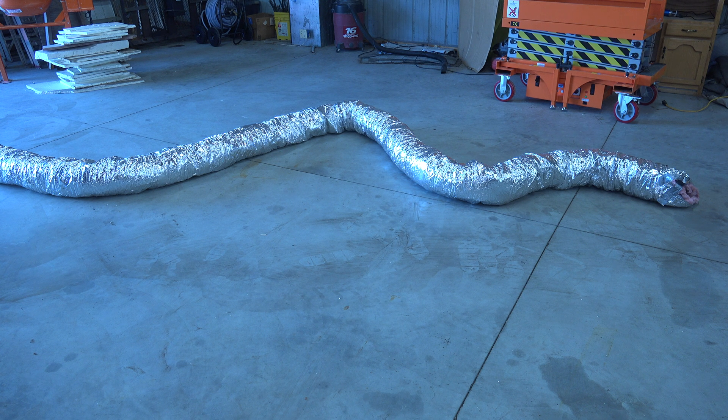This kind of work just makes it tougher when I have to come after and figure out why the ECM fan motor failed or why there's not enough air in one spot. ECM fan motors have failed because of excessive pressure in the duct — it tries to keep up, it can't keep up, and it eventually just gives up.